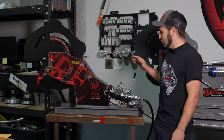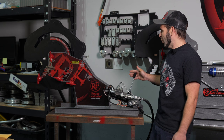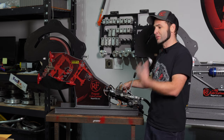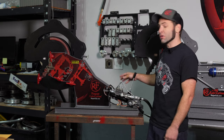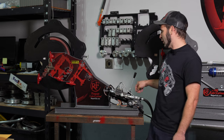This system has a joystick that's variable speed. It is louder and faster. One thing to know about the speed on this one is it has our older smaller tonnage cylinder — a smaller diameter — so it is of course faster. When you put that same volume through a smaller space you get a faster extension, so this will look a little artificially faster even though it is quite a bit quicker. This one is also equipped with our auto stop.